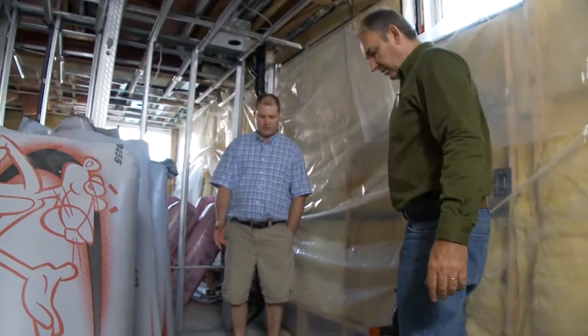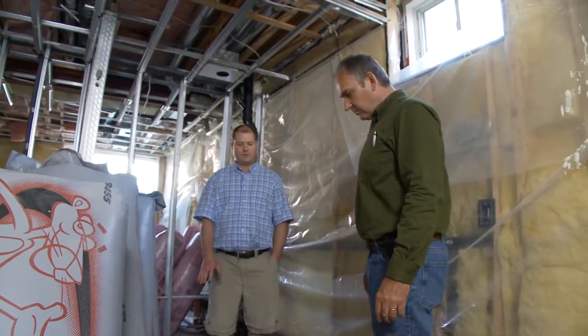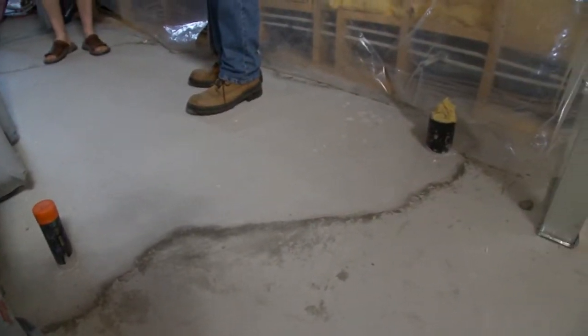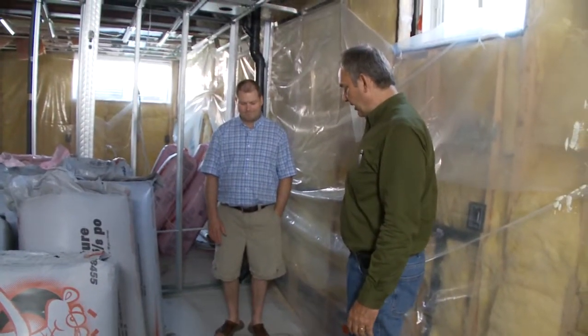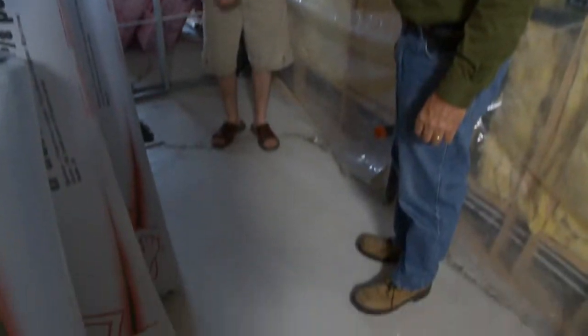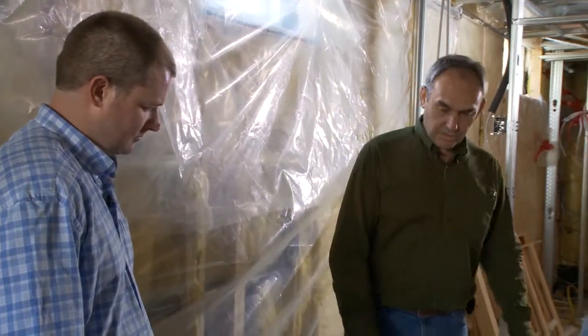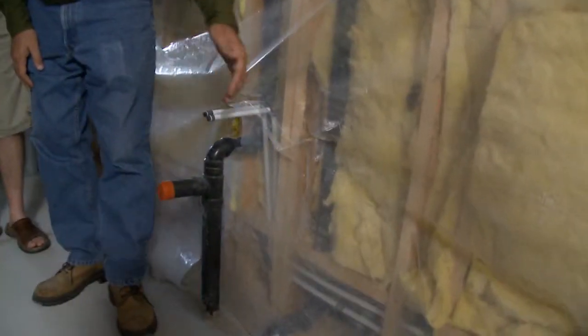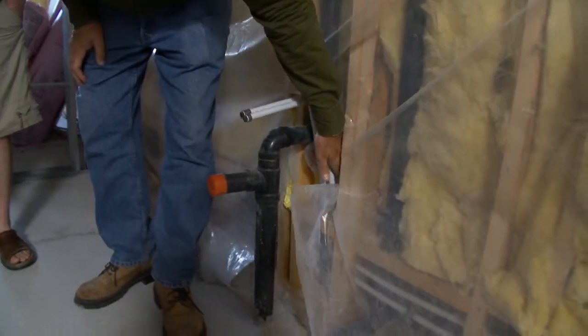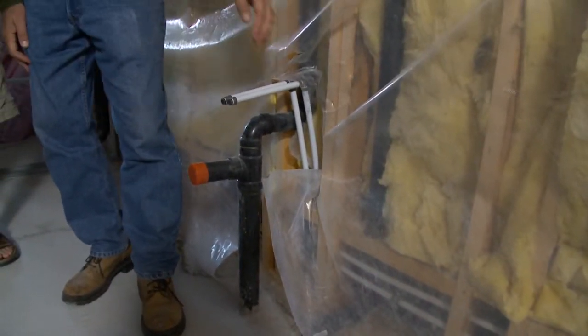The contractors repaired the floor after it was broken for plumbing, but it looks really rough. I'm not sure this is suitable for putting a floor on. Did they use a trowel to finish the cement? I believe they used a rough piece of 2x4. So they've screeded the floor with a 2x4, meaning it's not 100% flush. What we'll do is use some floor leveler — that will give us a beautiful surface to put the tile on. Also, they've put the plumbing in behind the vapor barrier, which has to be behind the plumbing pipes, so we have to project it through to the warm side.